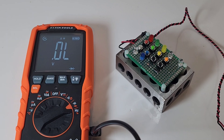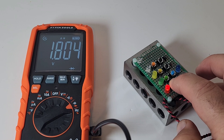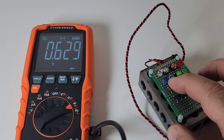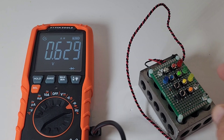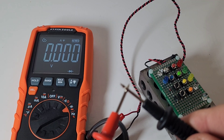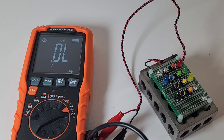Diode mode is next. When you put it on diode mode, it defaults to capacitance first — hit that select button to bring us into diode. Also, it doesn't remember that setting, so when you turn it back on again, you'll have to once again choose diode mode. Going against our diode tester: red LED, 1.84 volt forward voltage drop — illuminated LED. Over to the green, 2.3 volts. Yellow, lit with 1.9 volts. White, no problem. And the blue — 5 out of 5 in terms of illumination and forward voltage drop. Regular diodes, not a problem. However, we don't get that audible beep in diode mode. That is too bad. Just under 4 volts output voltage in diode mode.